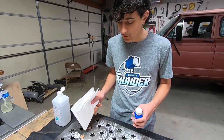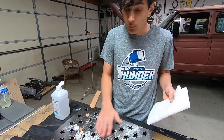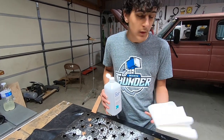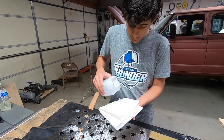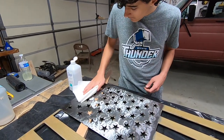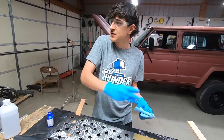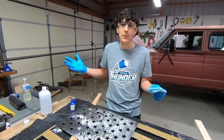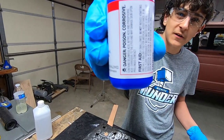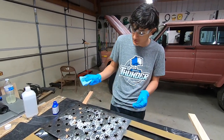In order for the chemical reaction to work with this gun blue stuff, the surface needs to be really clean. So we're just going to wipe this down with some alcohol, and that should get it clean enough for the gun blue to do its work. Starting with the gun blue process — we've got gloves, glasses, ventilation system going, the open door. This is some serious stuff. It has a legit skull and crossbones on it — it's pretty gnarly. So that tells you to take extreme precautions.